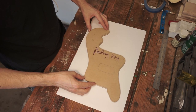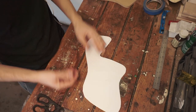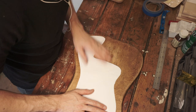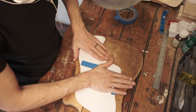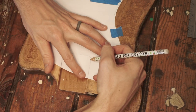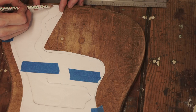This template that I made earlier is already in the general shape. So what I'm going to do is just rough trace, and I'm going to start out by making this a little smaller so it's easier to work with. If you don't have an original pick guard to work off of, you can cut it down little by little to get closer and closer to the shape you want. I'm going to get this roughly in place, feeling by the cavities. I'm going to tape this to the guitar — not where I'm drawing — just so I can push it down and get the cavities to show up, so I know exactly where my lines need to be. Basically tracing it with my fingers so I know what room I have to work with. You can also do this with a pencil. I know I want this piece to be a little straighter here, and I probably want these camel hump thingies to come down a little.